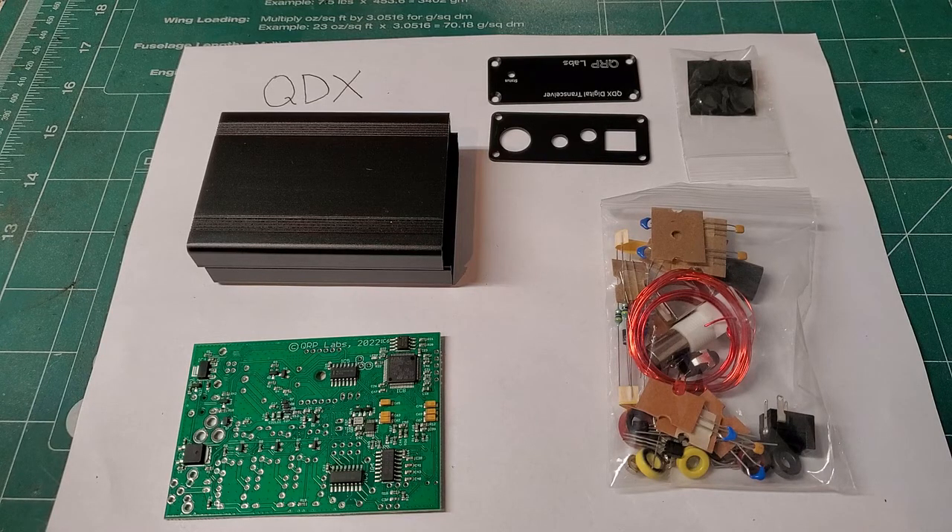Here's the kit, and this is the version that comes with the enclosure. Quoting from the manual — the QDX is a high-performance, 4-band, 5-watt digital mode transceiver with CAT control and a built-in USB sound card. In a nutshell, you run WSJTX on your computer and connect the QDX via USB cable. All the control, band switching, frequency control, audio, and a fairly rich set of diagnostic routines all flow through that single USB cable — a great improvement over having a festoon of audio cables running from your transceiver.